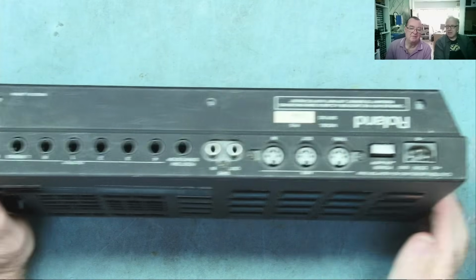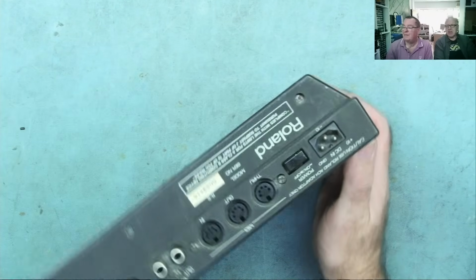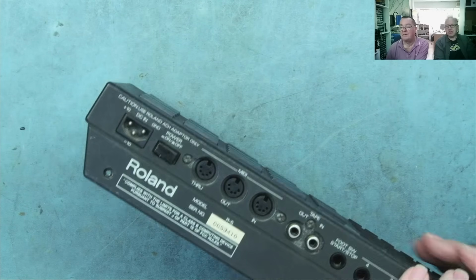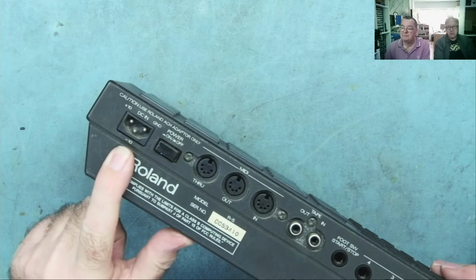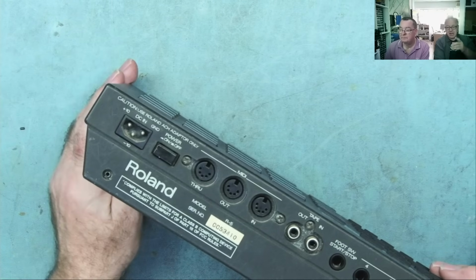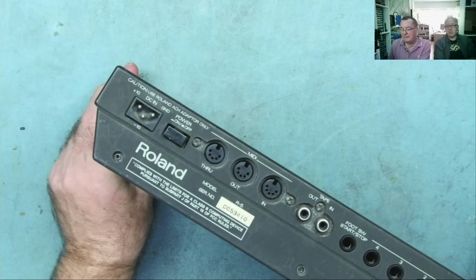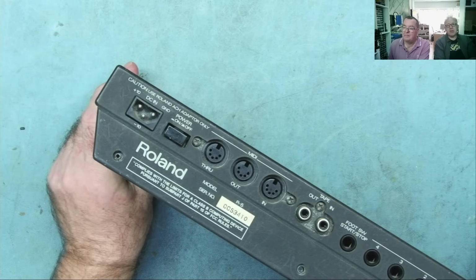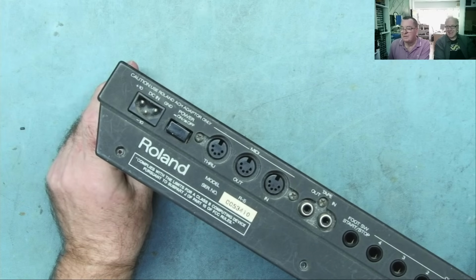If anybody recognized this little jack there, he's really good, because I only knew of this drum machine and the sister one that uses this weird connection over here. You see, you got plus and minus 10 volt, so 20 volt in all, with a ground connector. This connector was never used again, and I have no idea why they used it there. And you see my problem, because we got this drum machine without the power supply. This is why it was cheap. This is a real pain in the neck.